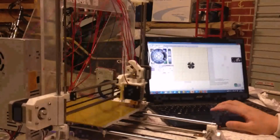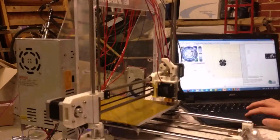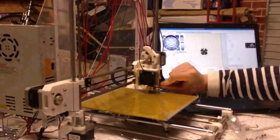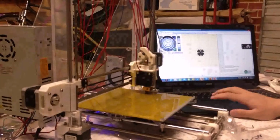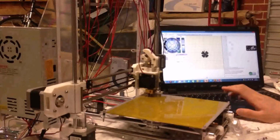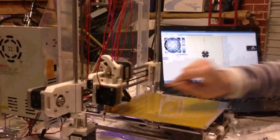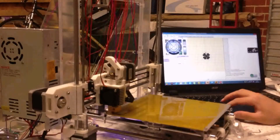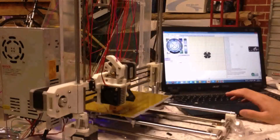So next is for the Y position. For the Y position, you can use the same way to press Y, like this, and just see whether the distance is the same between the extruder and the hot bed. And next, check again the X-axis from this side, whether the distance is the same. Okay, so next is press -Y to check this direction, whether it's the same or not.